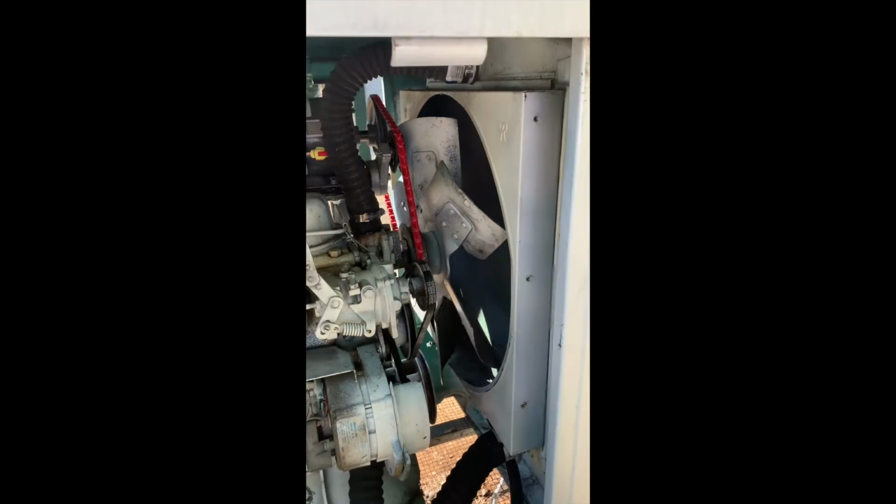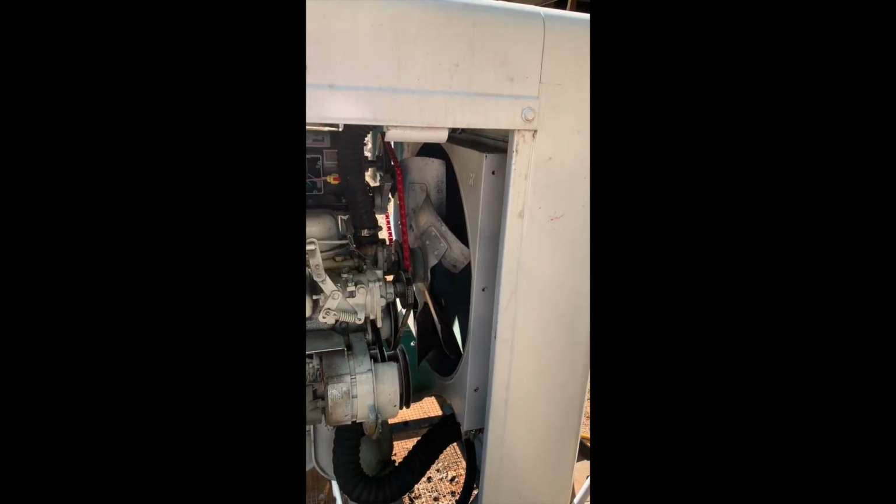The generator, when it starts, it turns the VFD on. The VFD is set to run at 10 hertz minimum, so it does provide a small amount of airflow across the components in the cabinet itself. 10 hertz would be 1/6 the maximum speed of the fan.